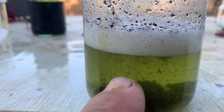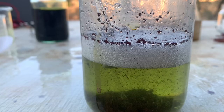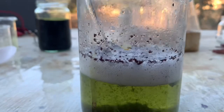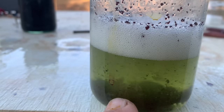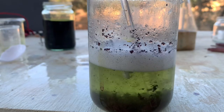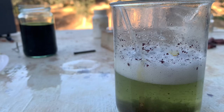And that hydrochloric acid doesn't let zinc come out of solution. The same with gold. When gold comes out of solution, all those tin, zinc, iron, and all those useless metals do not come out because there is still hydrochloric acid. But all the copper is coming, and coming first. Okay, so that way there's no problem using aluminum for gold recovery from solution.